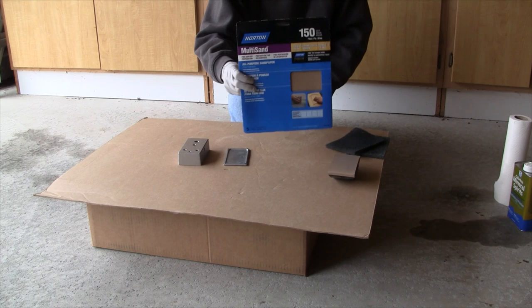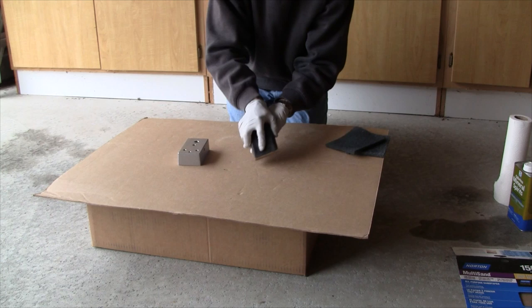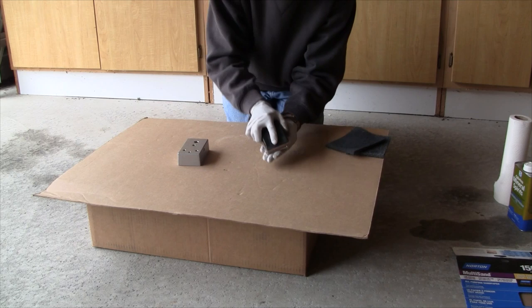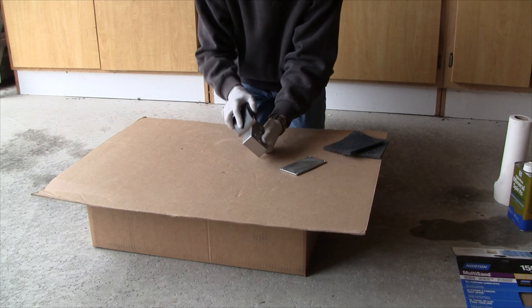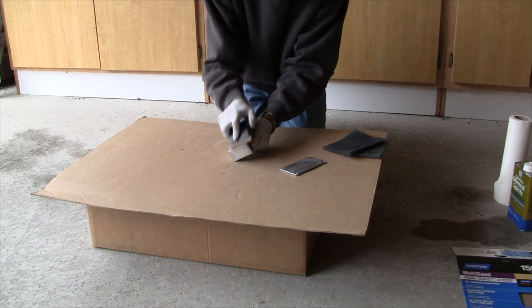The enclosure is drilled and ready. I've got some 150-grit general-purpose sandpaper wrapped around a rubber sanding block. I'm going to do some light sanding — my goal is just to get rid of any scratches or gouges. The aluminum is pretty soft so this won't take too long, though the sandpaper will gum up a little; just tap it out and the dust falls right out. Do all surfaces including the corners, always moving the sandpaper in the same straight direction — not in circles. This will also give you a nice brushed finish if you want to leave it as raw aluminum.